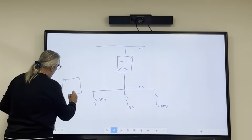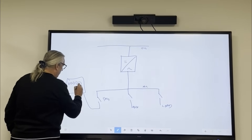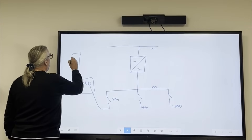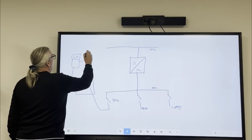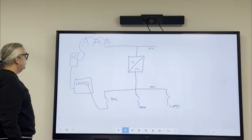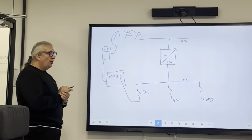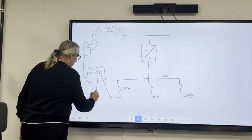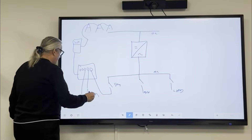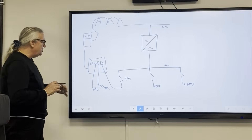The grid connects into a fuse box — my consumer unit — with all the fuses. This connects into the consumer unit, and out of the consumer unit we connect into a meter, a watt meter. Out of there it goes to the pylons and the wire. So that's my meter, my consumer unit, and the grid. On our non-essential side, we might have our sockets, hot water — lots of things going on here. This is the grid connection.